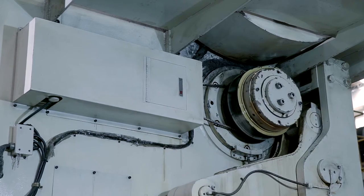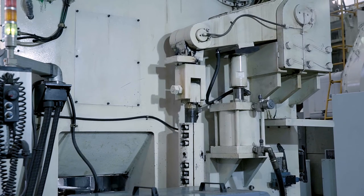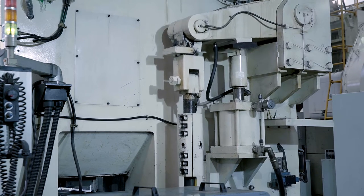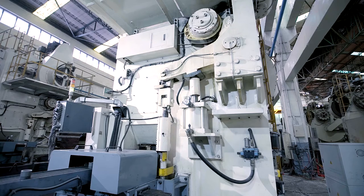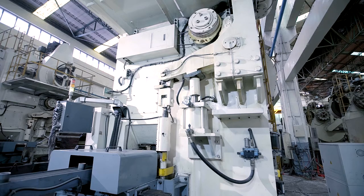The mechanical knockout device works from the cam in the end of the crankshaft and following lever on the side top, transferring downward along the conrod to the bed. The link mechanism inside the bed is driven to knock out the product as a result.